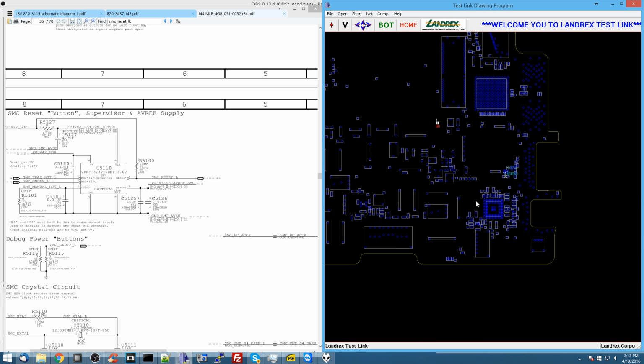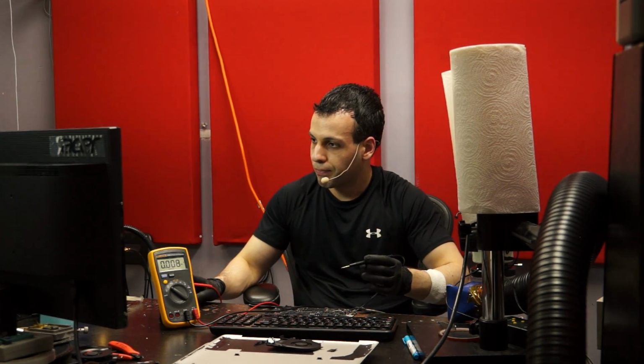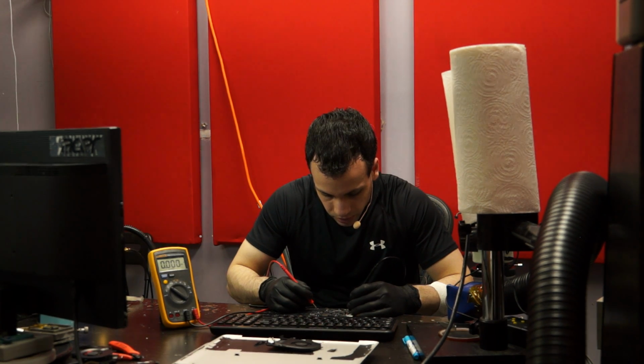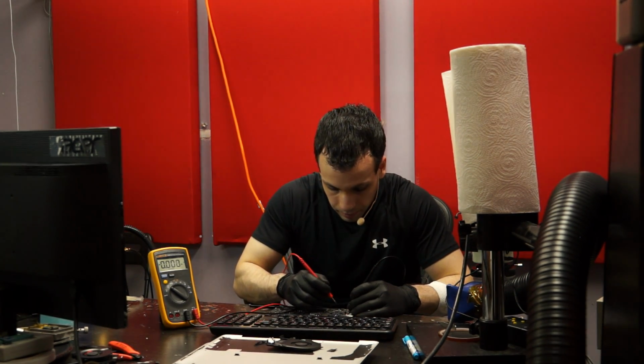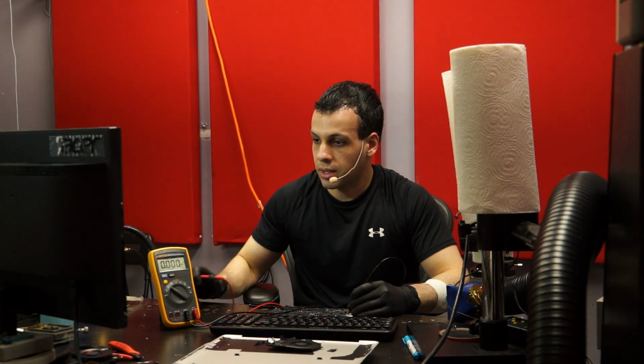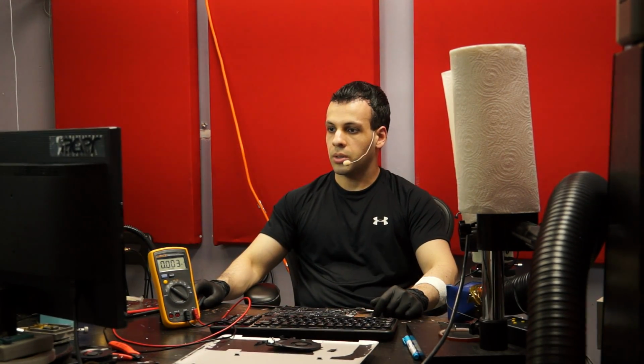So we're going to check for PP3V42 over here. And let's see what I get. So okay, I'm going to switch back so you can see this. Let's see what I get over here. So on PP3V42, it's there. I see it. All right. Now let's follow and try to figure out what's going on here.